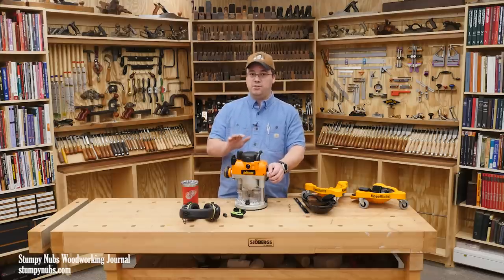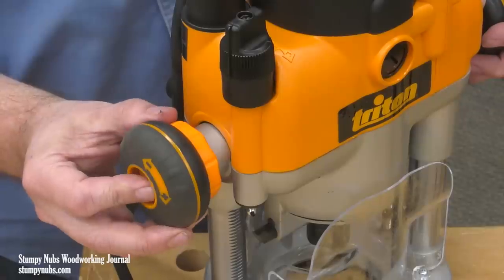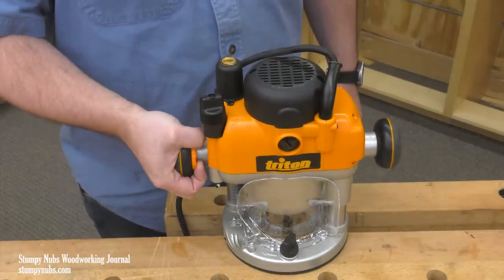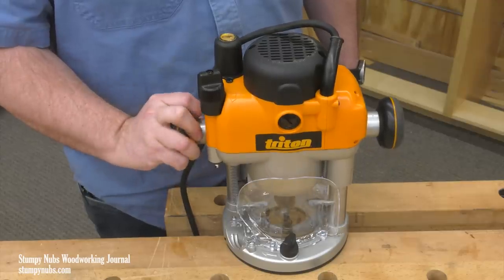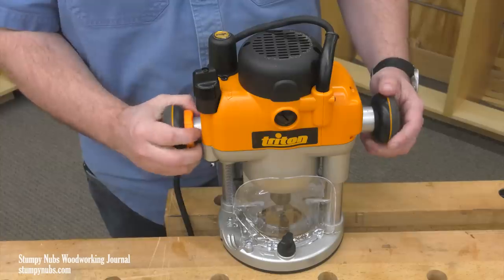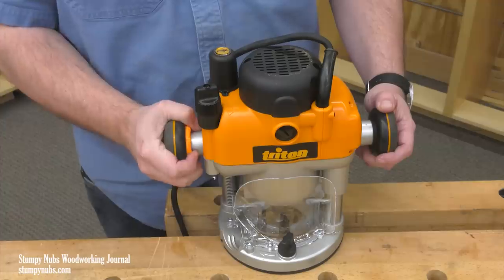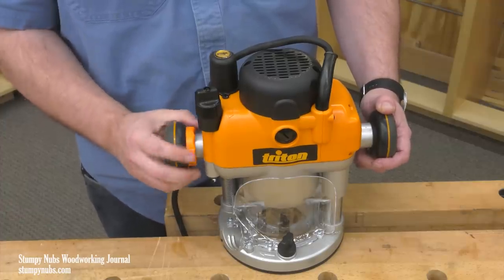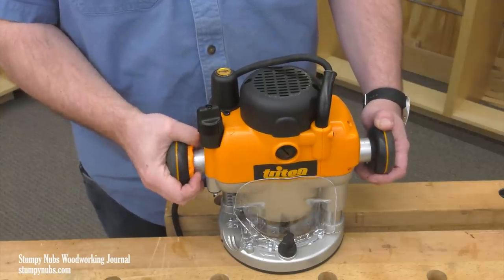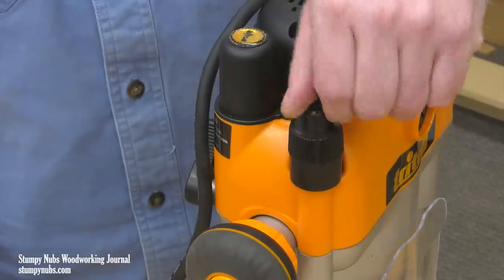Another cool feature is for handheld use: it has dual plunge mechanisms. You can move the motor up and down like a normal plunge router, or you can engage a rack-and-pinion mechanism and gradually plunge downward by turning a knob on the side. I find this very comfortable and easily controllable — it's one of the things that first drew me to this router. What I didn't realize at first was something even handier: when using the knob you have the option to engage a system of indents that allow you to plunge the bit in controlled stages, taking a quarter inch of material per pass. Having this built right into the plunge mechanism is incredibly handy for taking deeper and heavier cuts.